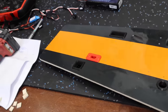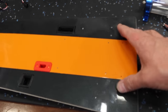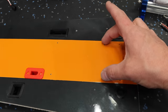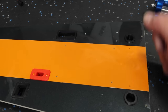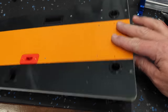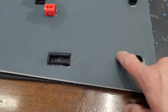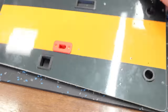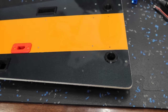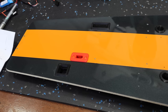All right, so we've got our tray layout basically all finished here. So what we do first is put our through fittings through, all the equipment's organized. Now we've drilled 4 holes for the UAT, 3 holes for the GS200 controller. So what we'll do is we'll put some plywood backing on the backside so we have something to screw into, because this is fiberglass and foam board. And then we'll get all of our stuff mounted, just making progress on this beautiful front end.